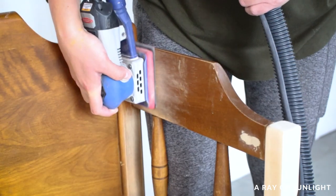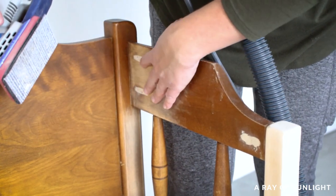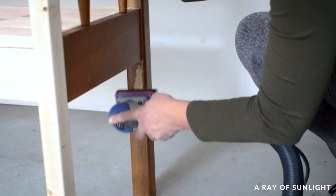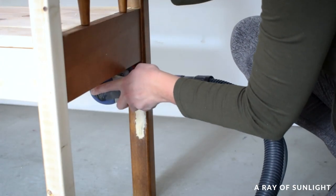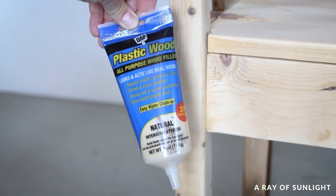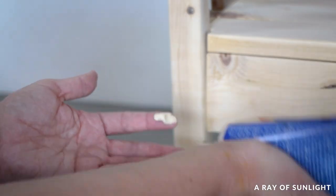When I got back to work on it I sanded the quick wood smooth with 80 grit sanding screens. Then I realized that the pine had a lot of imperfections — gouges and knot holes that should be filled anywhere that I planned to paint.